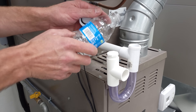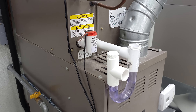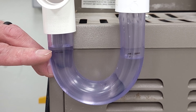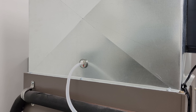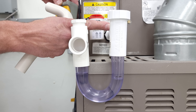Now we're going to add our water and mark it, then turn the power on so the blower motor turns on. You can see the positive pressure coming through the condensate line is pushing our water weight down a little more than a quarter inch on one side, and up a little higher than a quarter inch on the other. My static pressure manometer is reading 0.32 inches water column — positive pressure. The only reason you would put a trap on a furnace and coil is to avoid losing air being pushed out of the system to the outside of the building.